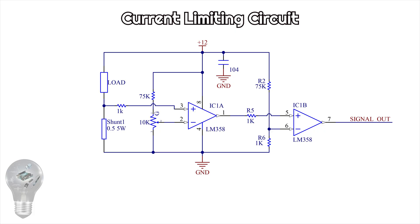This is the circuit diagram up to now. There is one point to note: the inverting input of the second op-amp is raised to a voltage slightly below 1 V — that is, just a little higher than 0 V. The reason is that when the non-inverting input signal is 0 V, for the output to switch state correctly, the inverting input must have a voltage higher than that level.